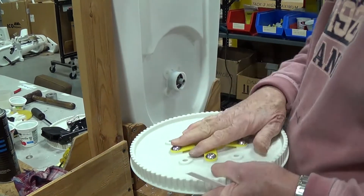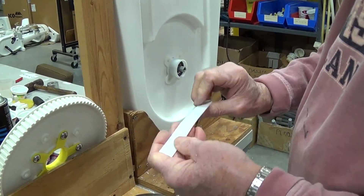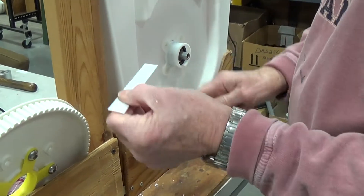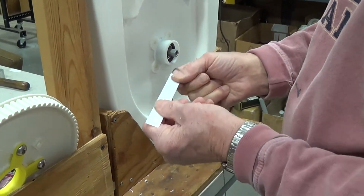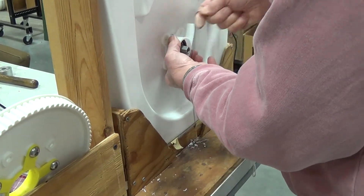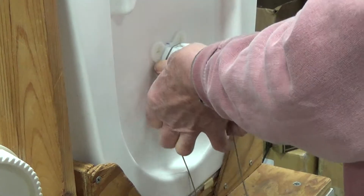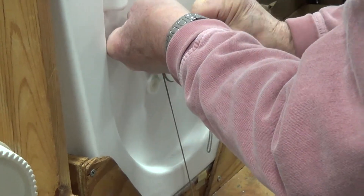This is the idler sprocket with this bushing in here, and this is a Teflon strip that we use as a bearing surface. This goes on here — we make it in strips like this. It comes in sheet form and we cut it to strips, and this wraps around here. We showed you this in another video on how we do this, or how it can actually be done in the field when this needs to be replaced.